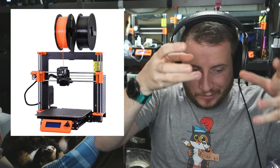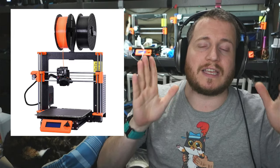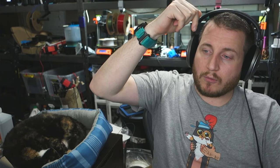We start asking: is the filament cut at an angle? Yes, it is. Can you remove the hot end and feed filament? I'm attempting to figure out if the hot end itself has a clog and if filament can feed cleanly without the hot end in the way. With the Prusa MK3S you can just drop out the hot end and put it off to the side while still connected — but don't do that very long because you'll lose cooling for your heat sink and will heat-soak it. When she removed the nozzle, she could feed right through. When she pulled the hot end off, it appeared the hot end was the problem because now the filament was able to feed completely through the extruder with no issues at all.